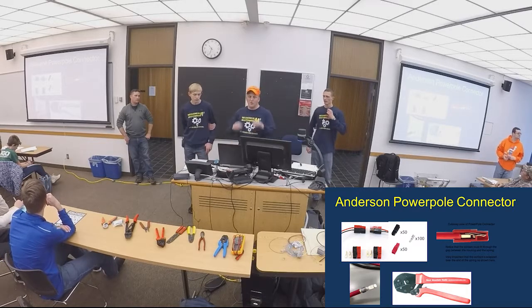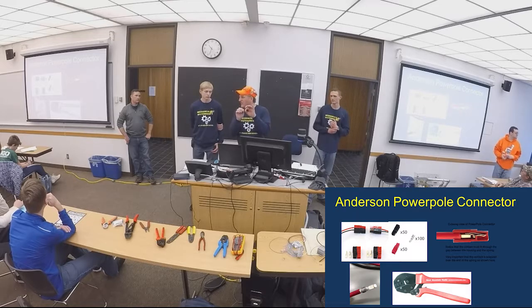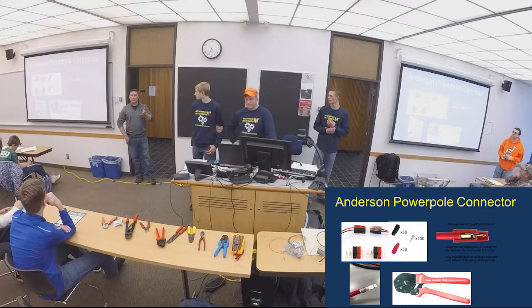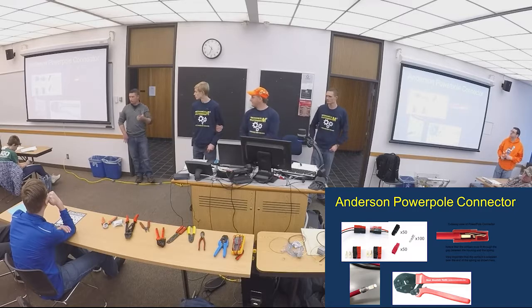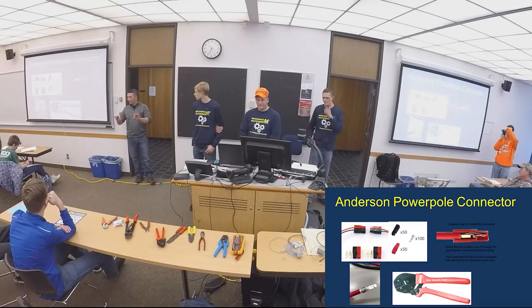Once you do it, when you push that wire in, you'll hear it click, and that's what you want to do. They'll give you instant feedback. There's no almost right. They're either right or they're not right. And like you said, if you get the click, they're right. Do a tug test. If you just pull them lightly, with minimal force, and they come apart, that's not right.